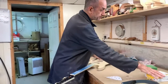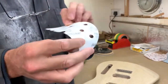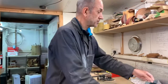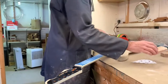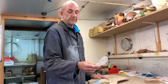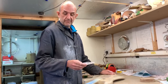So I don't do that anymore. I use micro-style paper which can be used dry. It comes in discs which I can use on my sander, or it can be cut up into any little size pieces you like. I cut it up into various size pieces and with a range of little curved and flat angled blocks I can get in absolutely anywhere. It doesn't clog, it lasts really well, and there's absolutely no risk of getting water anywhere you don't want it — which is basically anywhere near a guitar.